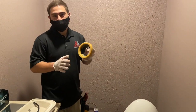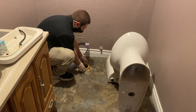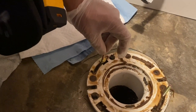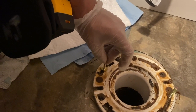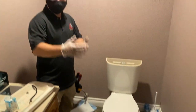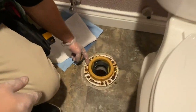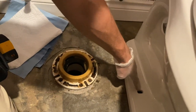Usually the easiest way to do this would be to actually install it in your drain pipe. Alright guys, so remember that when you slip your bowl in and over, you're actually going to want to put in and then twist so you can actually lodge it up against these little tabs here, that way it doesn't lift up. So the next step is to now actually install your toilet, and when you lift it and put it onto the actual drain pipe, you want to make sure that these bolts here slide into these holes here, okay?